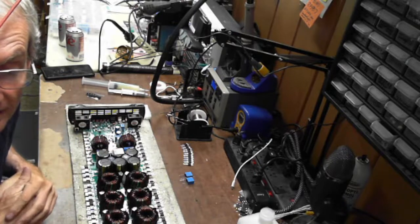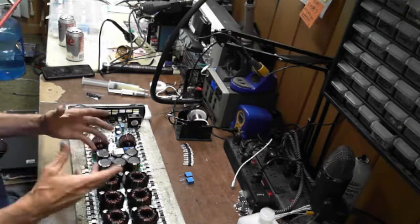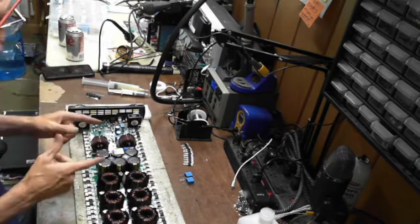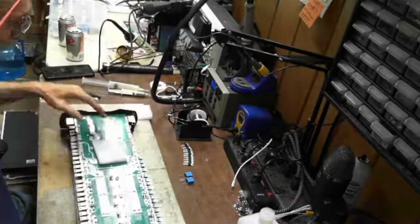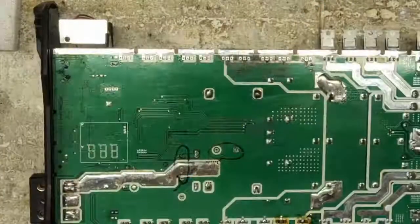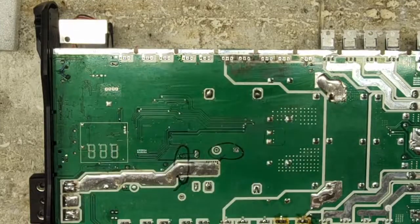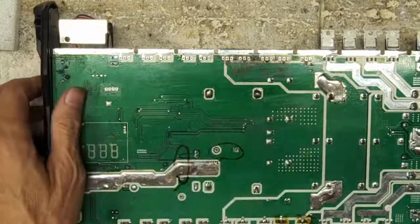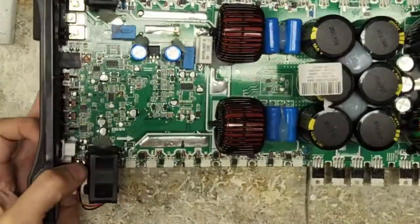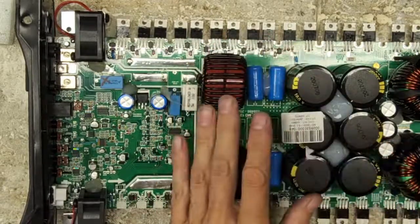See here. If you remove that inductor, you might work more comfortably. Yeah, but you know what? There's things I like and there's things I don't like. I don't like to remove inductors, only for the simple fact that they take the inductor leads and bend them over, fold them over to the top of the board. The thing about removing the inductors is, like any other copper wire, any other metal, you can only bend them so many times. And when you do bend them, you actually weaken that joint just a little bit. A common thing I see on Brazilian boards is broken inductor legs.